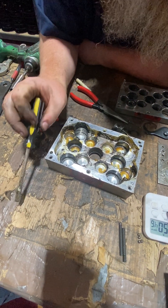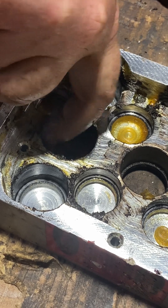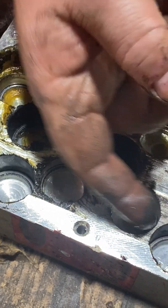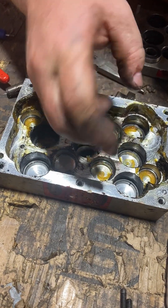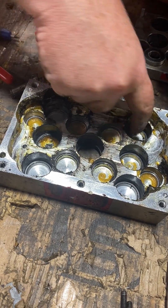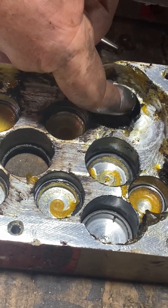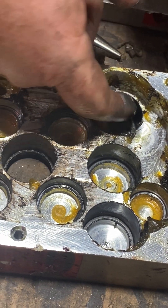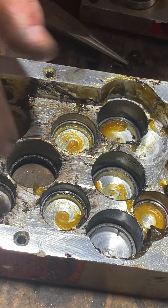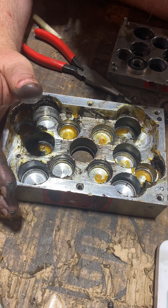Another check we would do on a head is to feel all the sides of the bearing journals, because sometimes a bearing that froze up will wear out part of the journal but not all sides — it might only wear on one side because that's the direction the torque pushes that particular spindle. Without knowing it, the best bet is just to feel all the way around or to look. Doing this field test right here, I can feel that this journal is worn and that the lower bearing has worked out the material, so that journal fails.